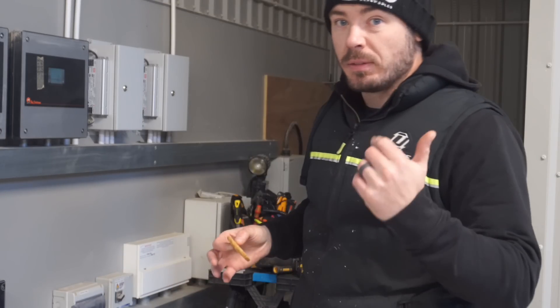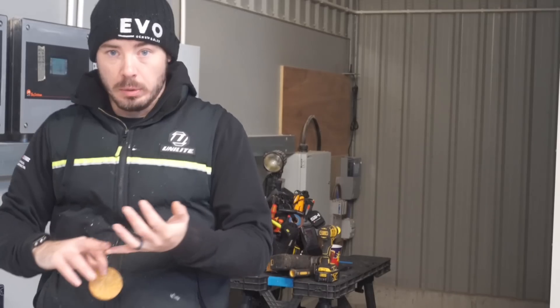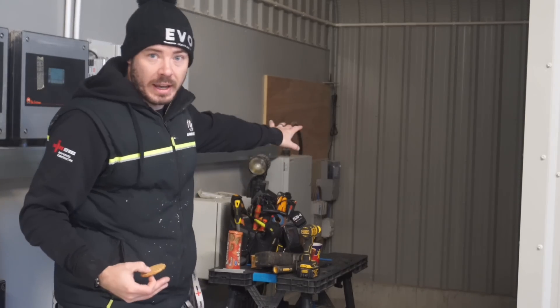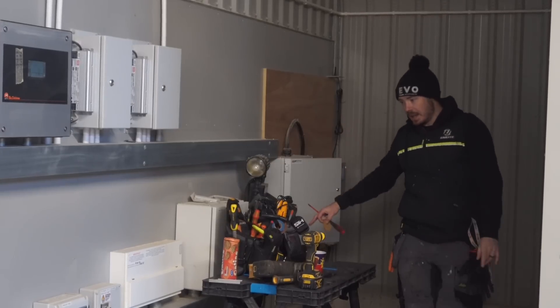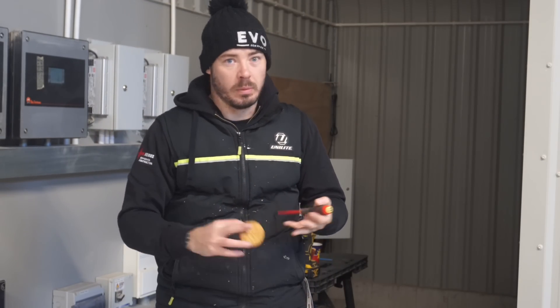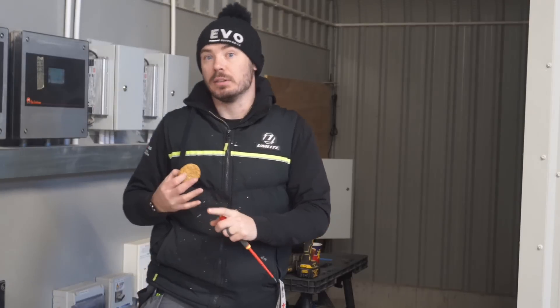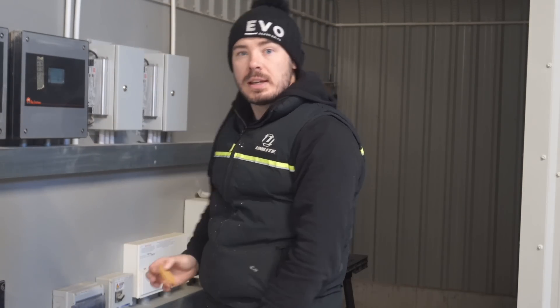Most of the equipment's in now. I've got my brew, which is the important thing. This back wall is where I'm planning on mounting all the equipment. I'm going to put a ply board back onto the wall and then a fireboard — the ply just gives us something to screw to, a little bit of strength. What we've got here is the dual supply: L1 and L2 feeds an upfront MCCB that then goes off to an ATS. There's also a second supply that goes to an RCD unit which powers a waste belt for the chicken poop. Because we've got L1 and L2 — not a three-phase setup — we're going for two single-phase inverters: a 10 kilowatt single-phase inverter for each orientation of the roof, each with its own isolator and meter, and the DC strings will come into each inverter.